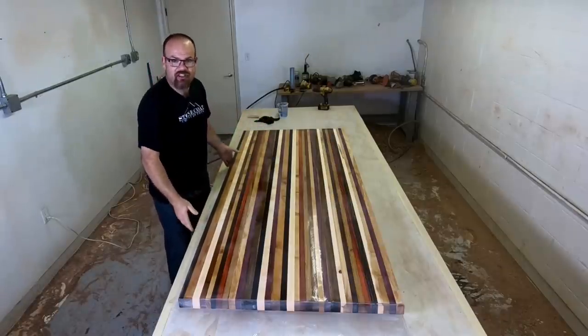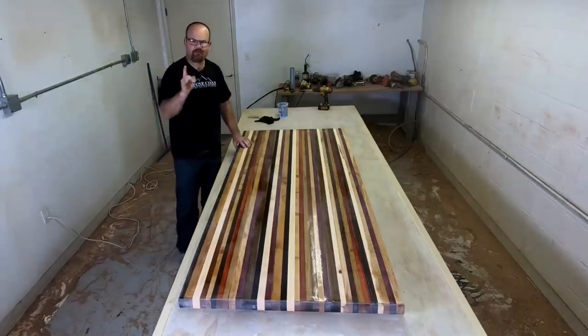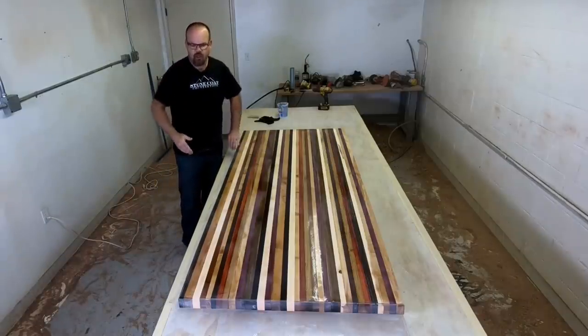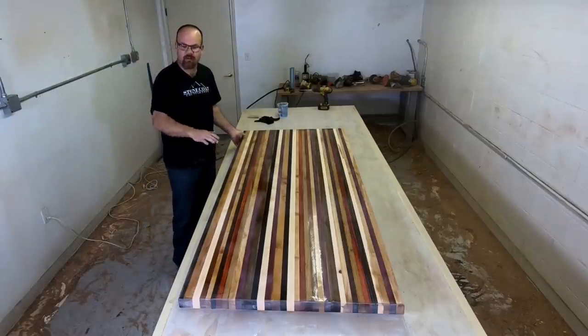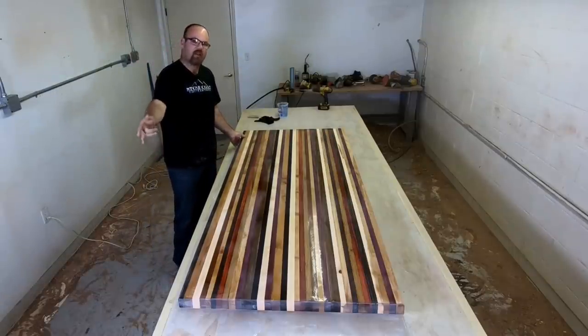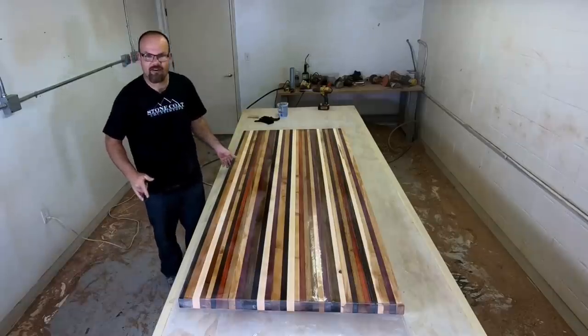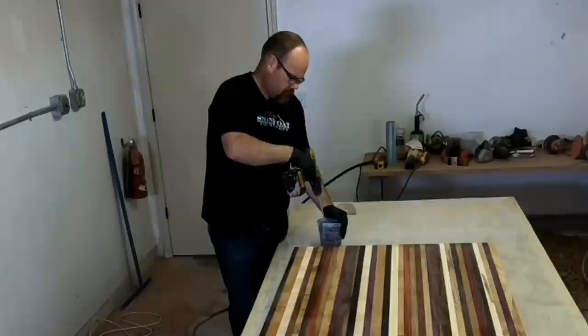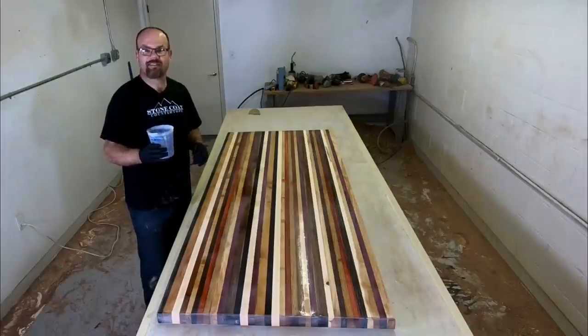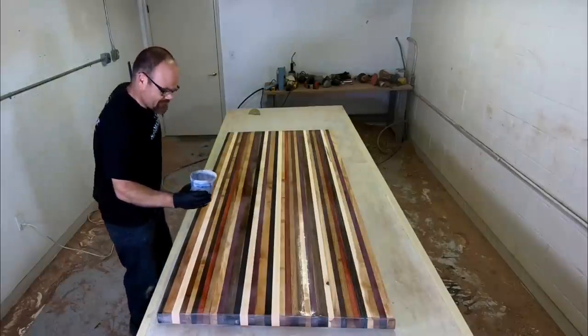Also on our edges, if you do have drips, that's what you want to get rid of each time. You don't want to have bumpy edges, so use that power sander on the flat part of your edges and make those nice and smooth. And then when we proceed to the second seal coat, it's going to come out even better than the first. Let's get started. All right, we're ready to pour our second seal coat. Let's get started.